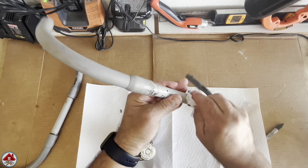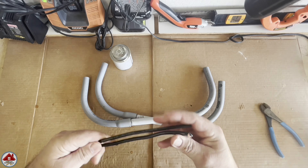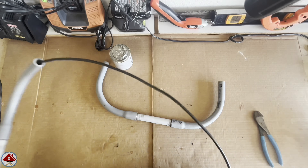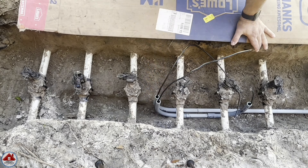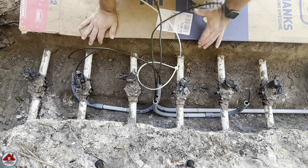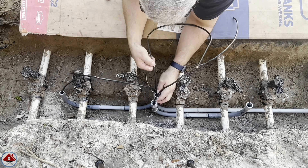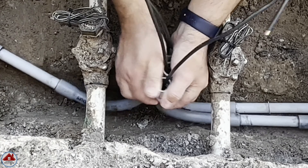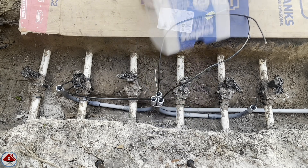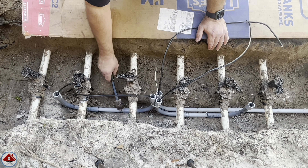I'm also going to feed the wire through them right here on the workbench. I had to run out to HD to buy 10 more feet of wire because I didn't want to have to pull more from the attic. So I fold it in half, cut it into two 5-foot pieces, and feed the wire through the conduit so it's prepped for wiring. I put them in place and use a long heavy-duty zip tie to keep them tight together — especially until I fill in the dirt — and cut the excess off. I slip couplings on all the ends for a more finished look. As I arrange them, they fall into a triangle and that felt right. I then add fabric staples right where the 90s end and hammer them in on both sides.